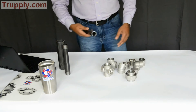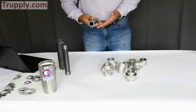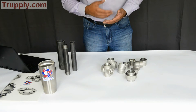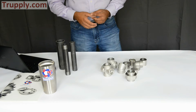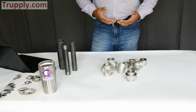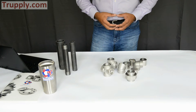We'll use a one-inch carbon steel pipe for demonstration purposes. Socket weld fittings are made in forged carbon steel, stainless steel, and nickel alloy. They generally come in three different pressure ratings: three thousand pound, six thousand pound, and nine thousand pound pressure class.